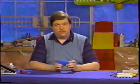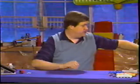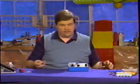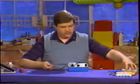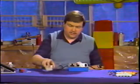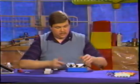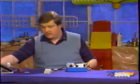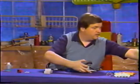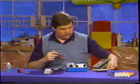But in the meantime, you don't really need that circuitry if you've got a digital voltmeter. This Astro AC-DC auto charger is one of my all-time favorites because it charges a lot of different cells. This is a beautiful setup. Connect the battery pack to it, and here I'm using a standard car battery pack. And you can dial in the current that you want and set the 15-minute timer. If you want to detect peak, you grab your little digital voltmeter and the appropriate leads.